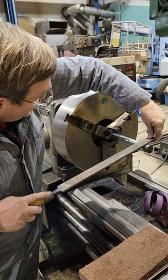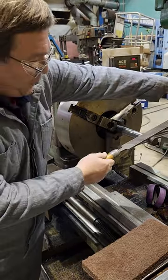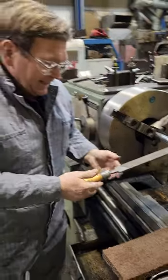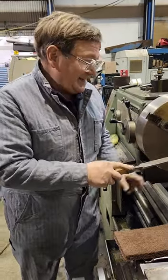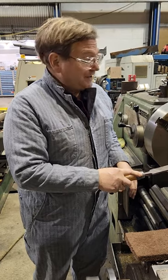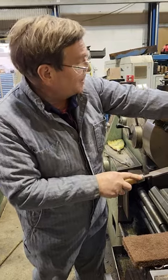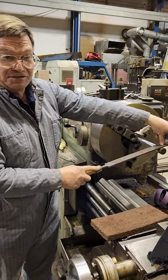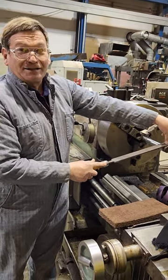You also have to be really conscious that you stay away from the rotating stuff — it's tough to do. There's also a force coming back from your part trying to push toward you, so make sure you have a handle on the file and that you stay away from things. It's one of those procedures that is done in this type of work, but you try to avoid it. When you do it, go that extra mile to keep your arm away. You're going to want to wear long-sleeve shirts around a lot of this stuff because of chips and sparks flying at you.